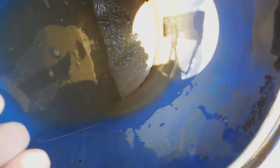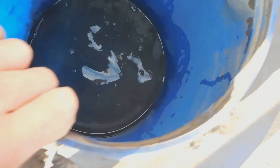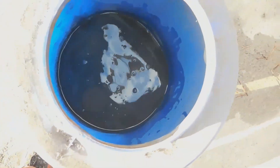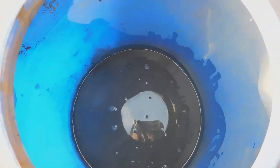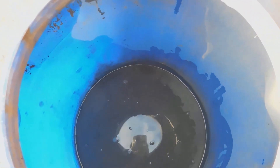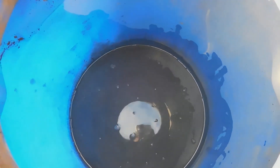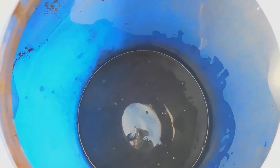You can see down the bottom of the water there's a big pancake of slime. So we just drain off the water off the top of that pancake of slime, and then scoop the slime out. When I let it dry, all that material — there won't be any heavy garnet in it. It is all absolute clay, super soft dust. Which is all of the stuff that comes off what you're sandblasting, as well as the broken up bits of garnet. The bits that break off the garnet stone itself, leaving the garnet stone back in the box.